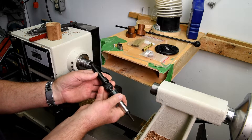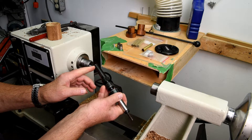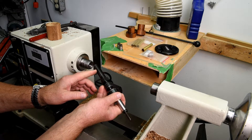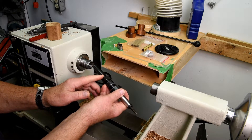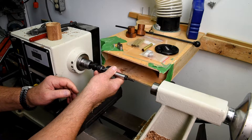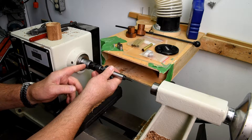I don't think I've bent it - I think it's still in good shape. What I'd want is to have my taper nice the way the Morse taper is. You notice how you put them in and you don't even have to press very hard, and there's absolutely no play - it's touching all the way along.